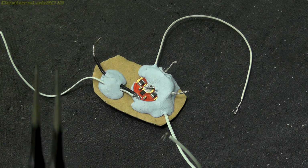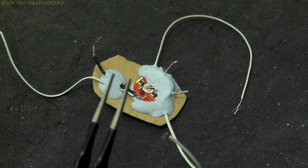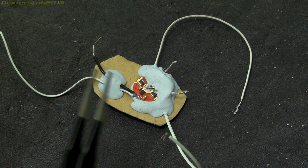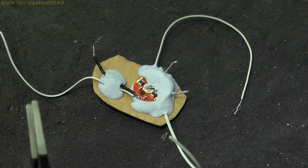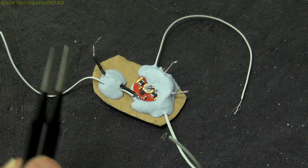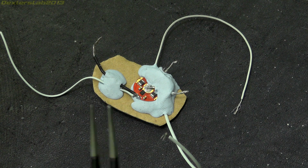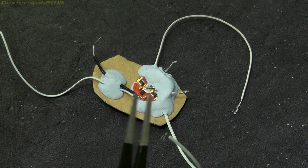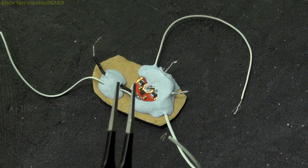During testing, I found a few other things of note. The Batteriser acts as a pass-through when the battery voltage is above about 1.35 volts. It does this with an efficiency of about 96 to 98%. This means if you have a fresh battery with a voltage of, say, 1.6 volts, the Batteriser is effectively in a sleep mode until the battery voltage drops to about 1.35 volts.